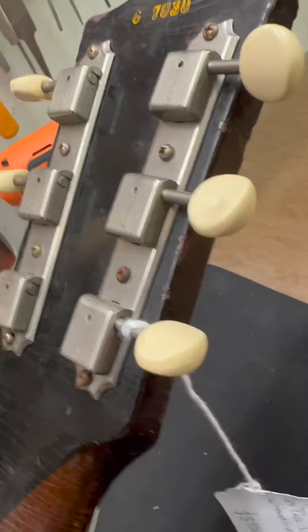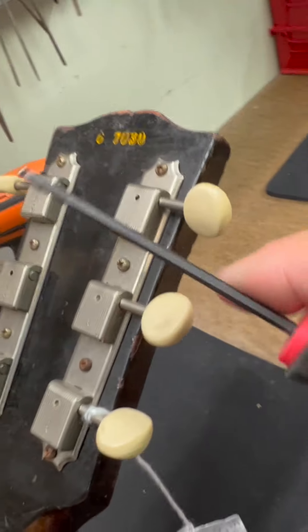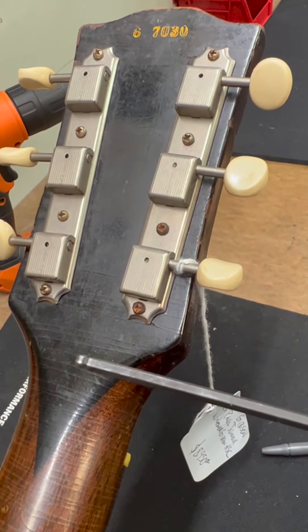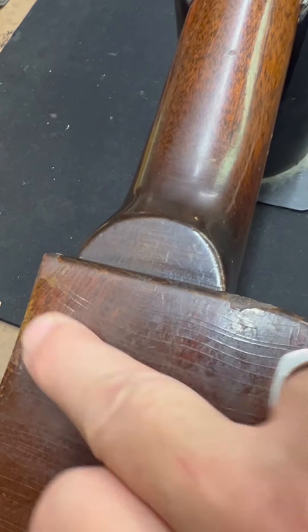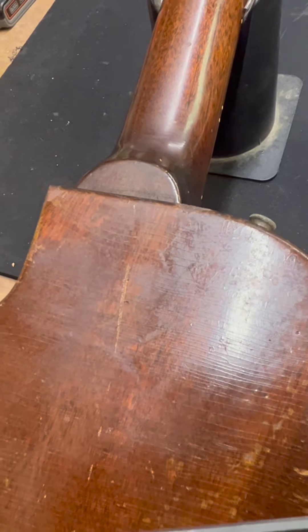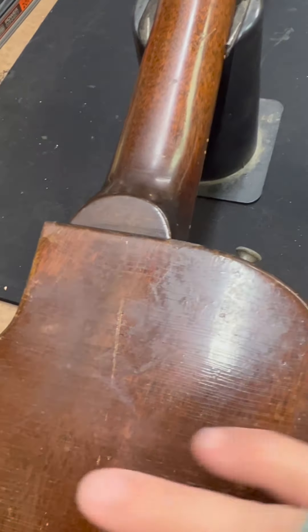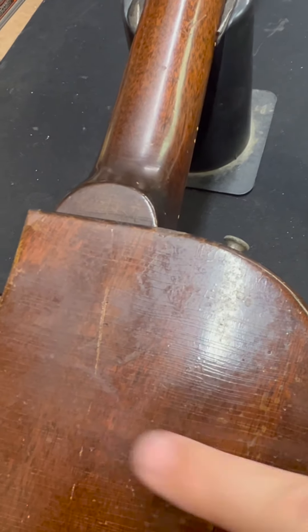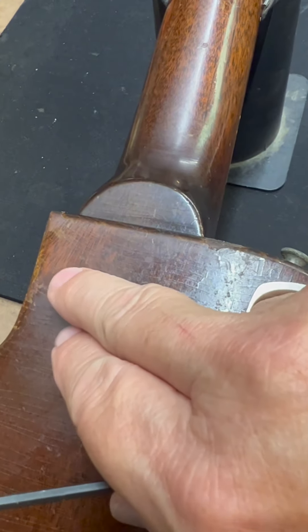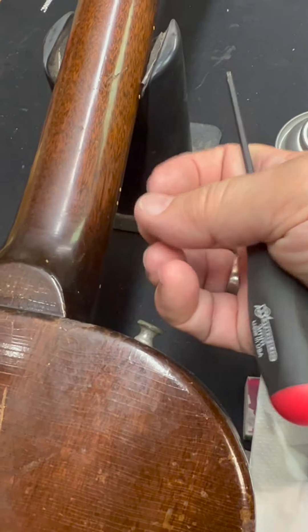As they would cut the wood and it angled up, you'd sometimes find end grain sticking up this way. The simplest way is to cover it up — otherwise what they do in these guitars is they'll fill the grain, and that takes some time to keep filling the grain. It is very time consuming. Those unfilled areas will suck in some of the finish and the finish will sink. It's a perennial problem.